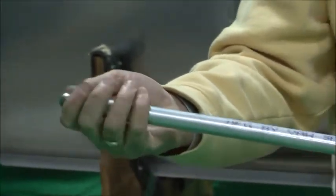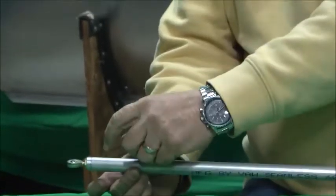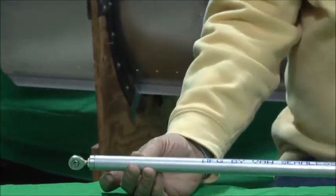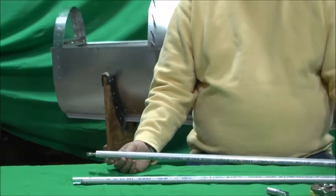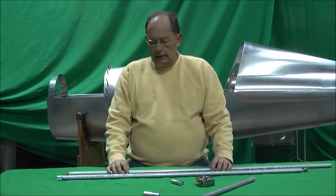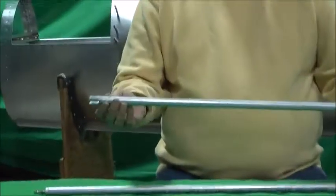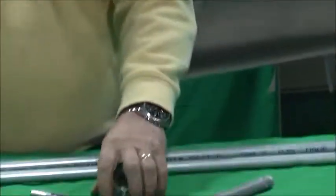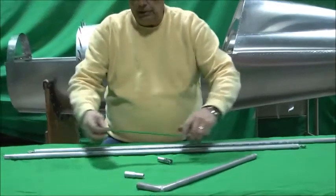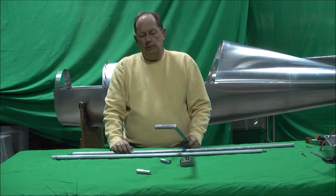It just works out that each end of this, if you subtract about an inch from your overall length, that'll give you the cut tube length. So an inch for each end — two inches off of 43 and 3/4 — we'll cut it at 41 and 3/4, which we have done here. You can see these fittings — this happens to be a C1007 that goes in a 3/4 inch, 0.035 wall tube. It's hollow, countered on the inside. Once that's in and seated all the way down, the plans will call for four rivets. You come down about a half inch from the end of the tube, cross drill clear through — that gives you two rivets — then rotate 90 degrees, cross drill clear through for two more rivets.